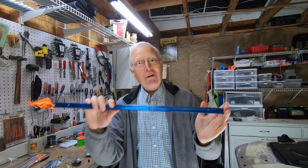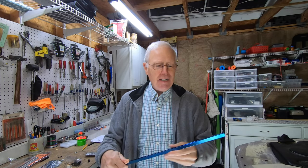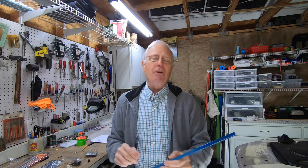I like using well nuts because I believe that's the strongest way to attach something like this. But you could also drill some holes — you'd have to do it in two stages. You drill the first hole that would fit the screw you're going to use tightly, then take a larger bit and countersink that a little bit so you could get the flat head screw all the way down there.